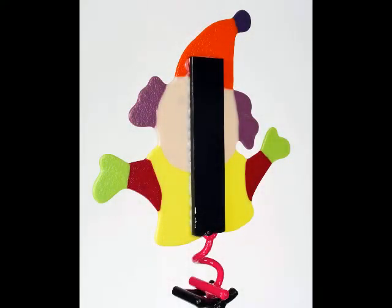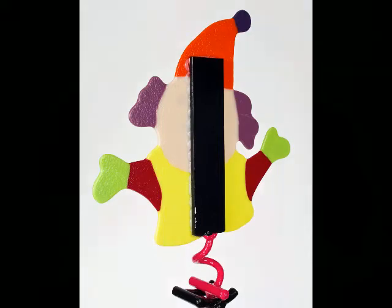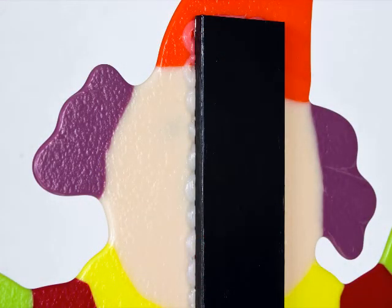I ended up using a quarter-inch plate for part of the counterweight for the top portion. That quarter-inch plate also provides support for the fused glass. Attach the fused glass to that quarter-inch plate using silicone, and at the joint you want to actually leave a little bit of gap. That will allow the two mediums to expand and contract differently without breaking the glue joint. That's one of the reasons I don't use epoxy — epoxy is very rigid, and the glass and steel have a different coefficient of thermal expansion, so you have the potential of actually breaking the joint. With silicone, I've had pretty good luck if you leave a little bit of gap, so it'll allow it to expand and contract differently.